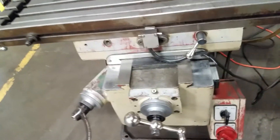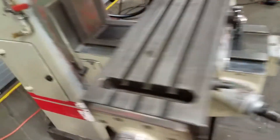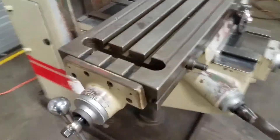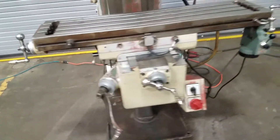This is the Y-axis, and your Y-axis has got about two and a half more inches than a standard Bridgeport. The saddle is a lot wider. Table is a 10 by 42. Most standard Bridgeports are 9 by 42.